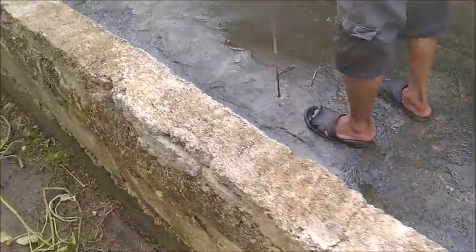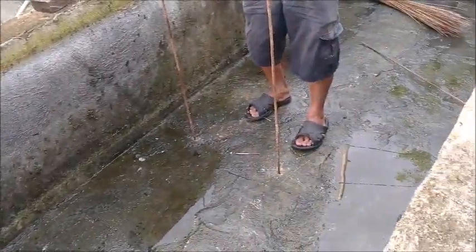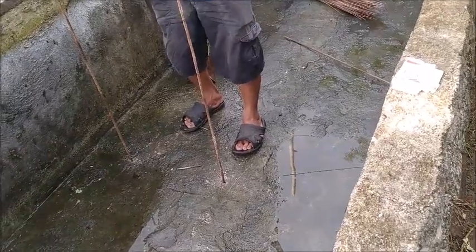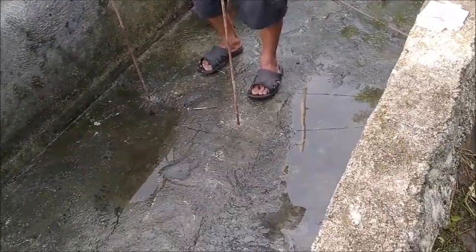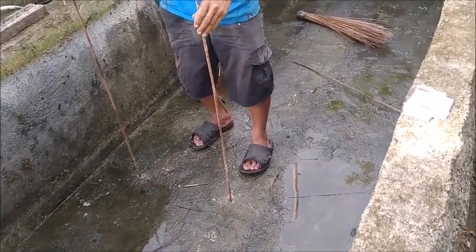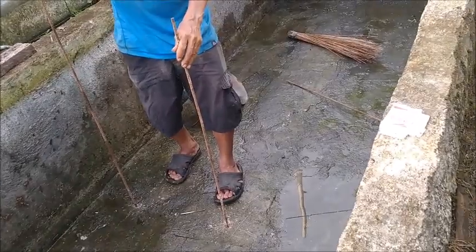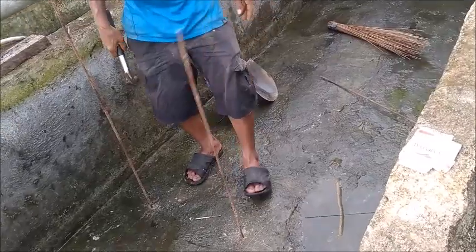What we're going to do now is Marcel has gone into town to get 10 hollow blocks, a ball valve, and 3 bags of cement, and hopefully that'll be enough to partition this one large pen into 2 small ones and put some slope in this floor, I hope. Tata is laying the form bar now to hold the hollow block, to strengthen them a bit.